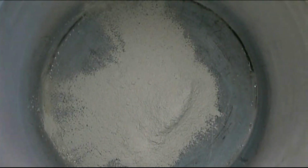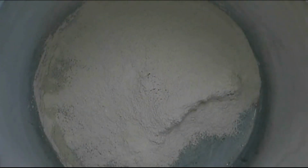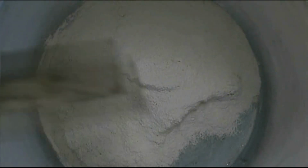Put dry material needed into a bucket. Add water to Easy Patch number 1 Fast Set and mix thoroughly to the consistency of stiff mashed potatoes.